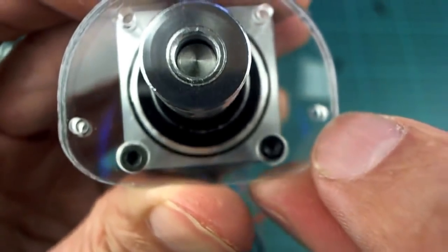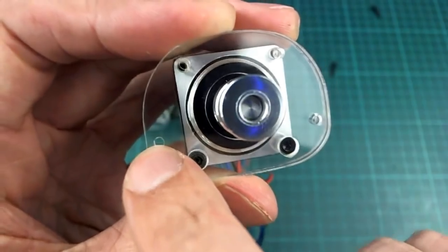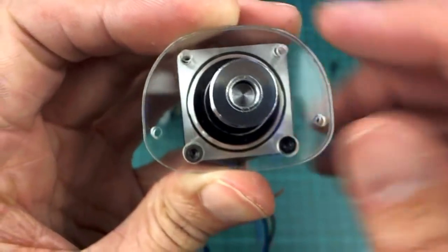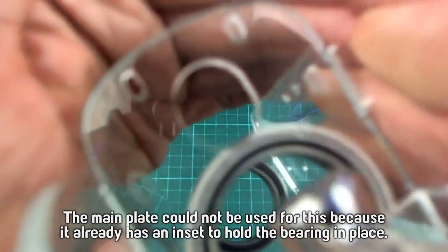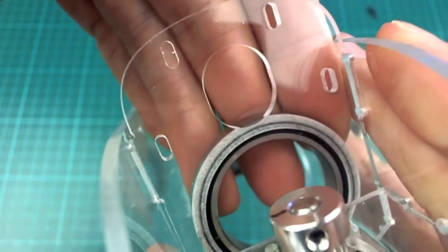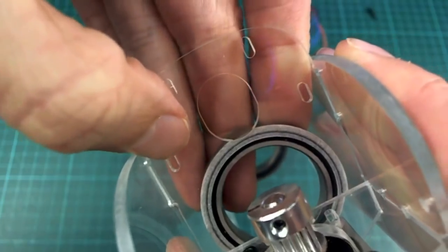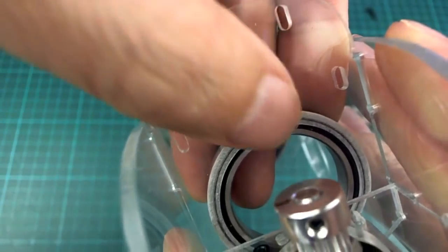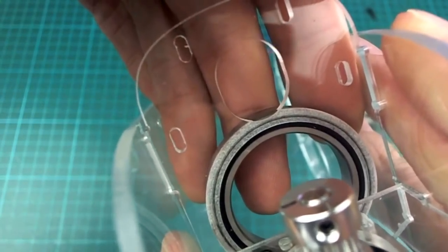And it's got a little bit to the outside here, so now we have 4 holes. These 2 holes at the top can be used normally, and these 2 holes needed to be a little bit up and further away, so we can still secure these points to the main plate. Let's see if I can show you this. Here we go. So now we've got these 2 points there just under my thumb and there just under my thumb, and those are not going to be in the way of this large bearing, and I can still get at them with my screwdriver to tighten things up.